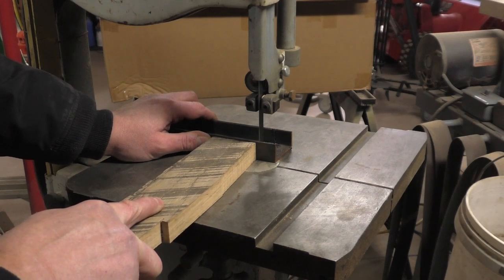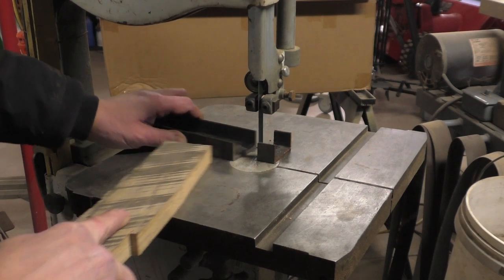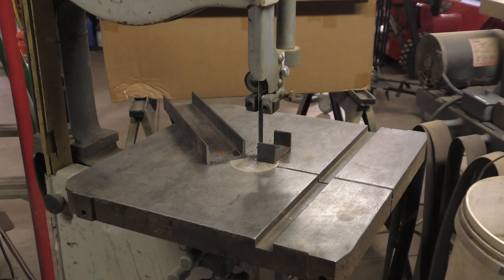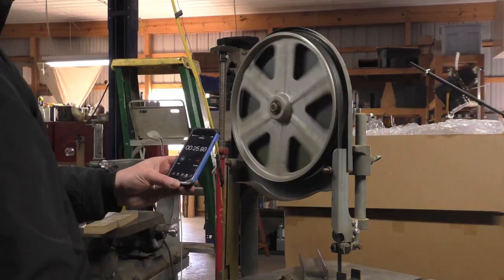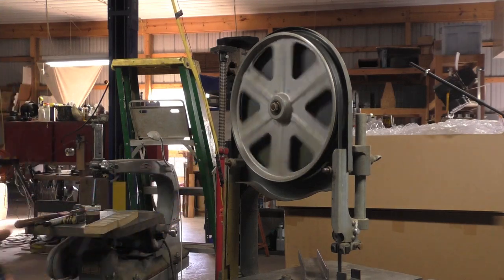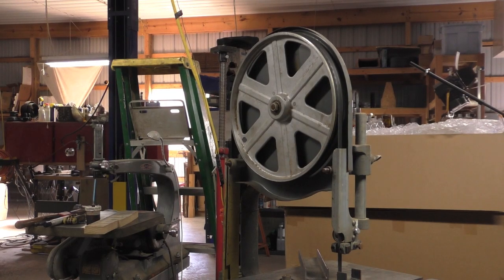Cutting this channel goes from 1/8 to 1 inch. That's kind of a nice test because you see what it's like cutting about 1/8 inch, which is pretty thick, to 1 inch, which is really thick. Sort of feel that a faster speed might be better. But let's find out. Put a mark here. So that was a little less than 30 in 30 seconds. So 60 RPM.